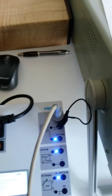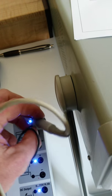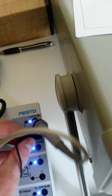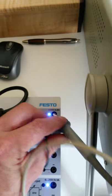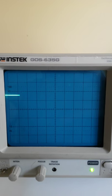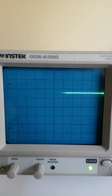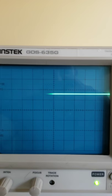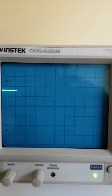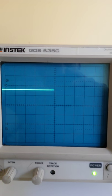and the 15 volts. Okay, you'll notice that I'm connecting up the ground pin here to the center tap. Okay, so that guy is supposed to be providing us with 15 volts out. Okay, you can see here, I'm on the times 10 scale. So each one of those solid lines on the screen or on the display is now worth 10 volts. And if we center in here, we can see that we've got a nice straight DC voltage coming out at a value of 15 volts.